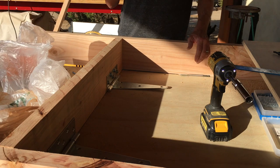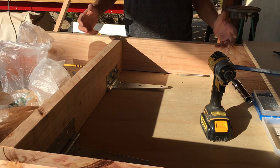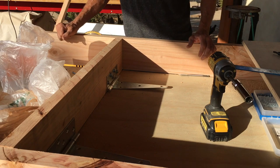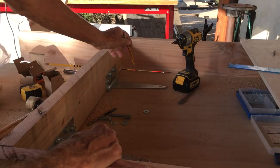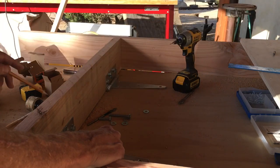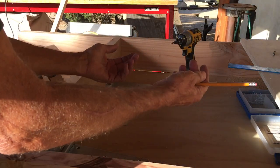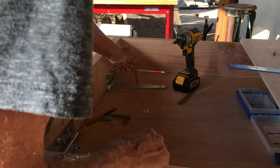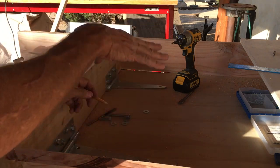The Fitbike is going to go up in the air. Why are we doing it like this? When we first started making these incline tables we put the pivot in the back, but there was a lot of weight — the Fitbike and the rider. The whole complex had to be lifted up in the air and that was hard to do. So we made a teeter-totter instead. The pivot should be a little bit back of the center of gravity. Where we put the holes for these gate hinges is going to describe exactly where this plate lines up on this frame — we've got about an eighth of an inch gap all the way around so that this plate can rotate inside this box.